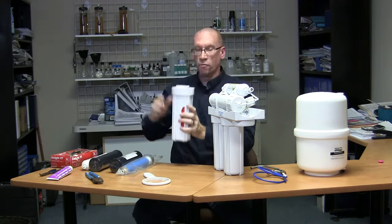Take your food grade silicone lube, put a little bit on your finger, and run it around the O-ring. The main reason for that is if you don't lube your O-ring, next time you come to do this — six months or a year from now — it's going to be harder to take the O-ring off because it's going to seal. Just a little finger full; it doesn't have to be a lot.